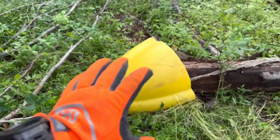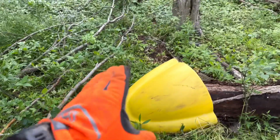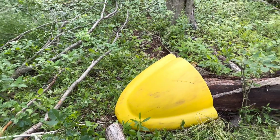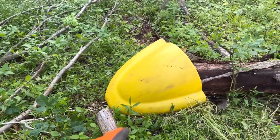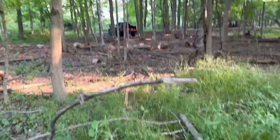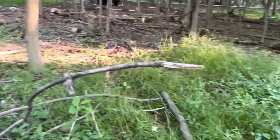essentially increase my pulling force from 1600 pounds max to 3,200 pounds. So, right? Yeah, 3,200 pounds. So anyway, let's give it a go with a single line pull and see if the winch can do it. If not, I'll throw a snatch block on there, double up, and we'll pull it up to the truck.